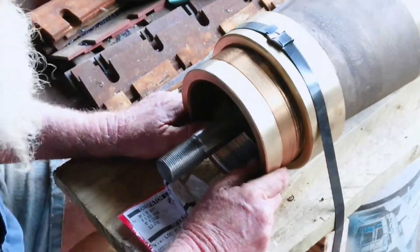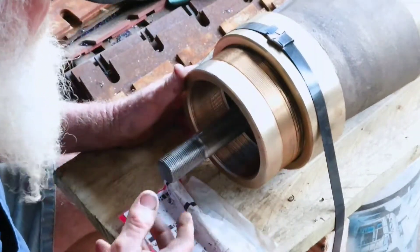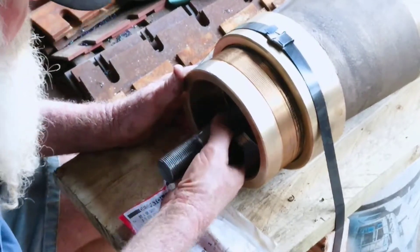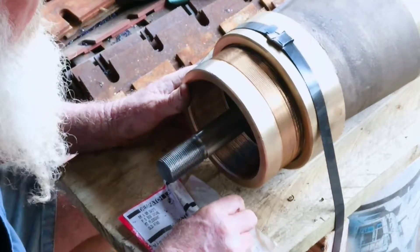This is a down-the-bore pump, an impeller pump, six stage, six inch. It has a five inch column that comes off and an inch and a quarter shaft, which steps down to a one inch shaft, and the pump motor drives it from the top.